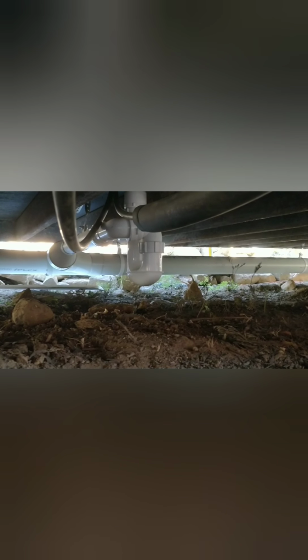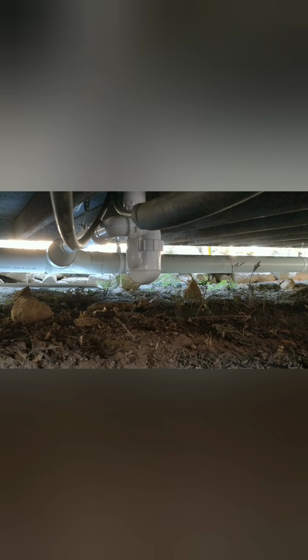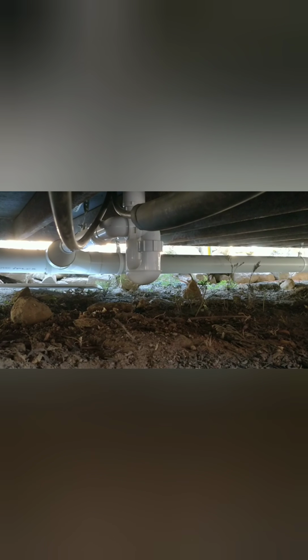That'll be the outlet for the dishwasher, because on that little dish drawer dishwasher, I was very surprised the water outlet is like a pinky finger. It's only really quite small, so it must come out at a fairly good bit of pressure. And then our main line runs out for our sewerage out towards what in Australia is called a surcharge gully, which is just the lowest point with a vent.